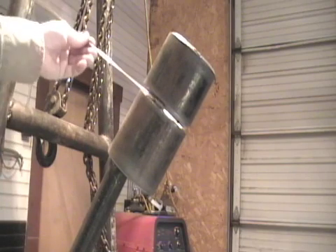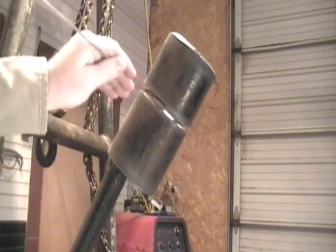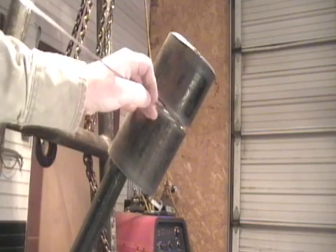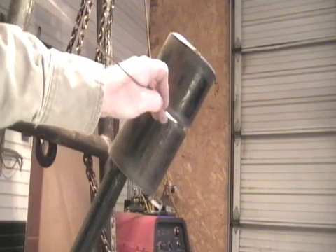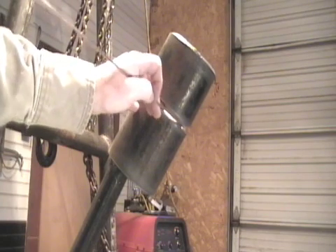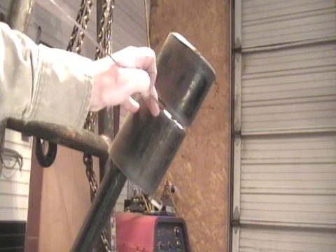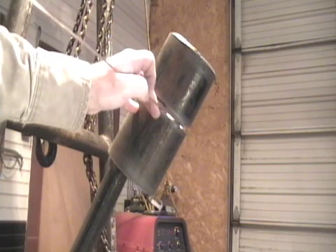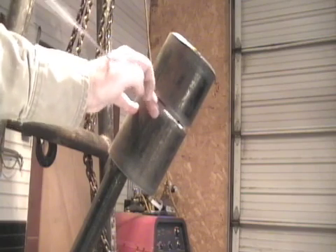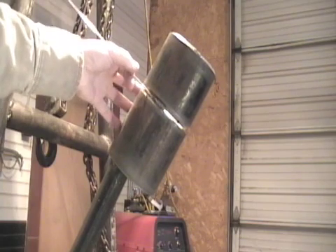If I can't get my rod through the bevel to get down like we've normally been welding, you can come in from the bottom and weld from there. But if you couldn't get that in there at all, you would absolutely have a tough time pushing this in and getting enough weld material on the interior of the pipe welding this way. It's not as easy as welding from inside the bevel — shooting the gap.